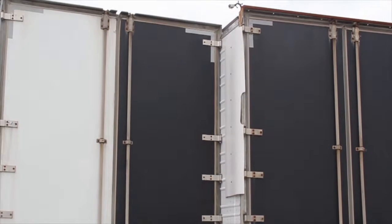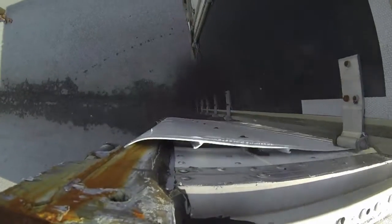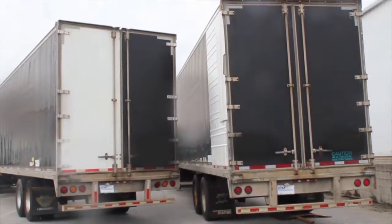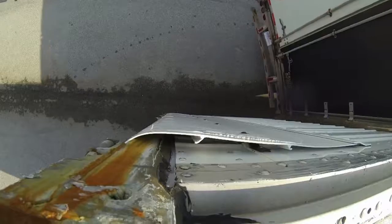A destructive test is always part of the initial evaluation of new designs and product releases. In this case, we mimicked a worst-case impact or load scenario by driving a trailer into and scraping another trailer forward and backward at a minimum of 25 times. Both flat trailer and corrugated sidewall versions were scrape tested.